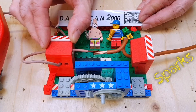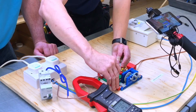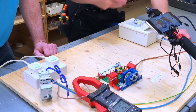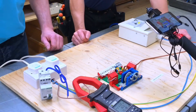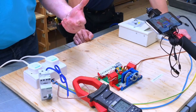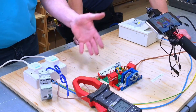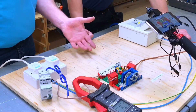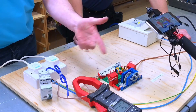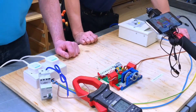Previously when you did it, you then went to a third stage. We've increased the current being drawn - but what was the third stage? The first stage was to cheat and apply some water. With a damaged cable that has a cut in it, some medium other than air - like water - may get in there. So it's not completely unrealistic to see water get into where a cable's been damaged. We're increasing the parameters required to cause the device to operate - we may have to introduce moisture.